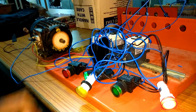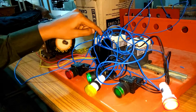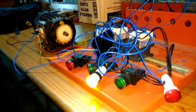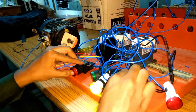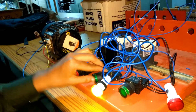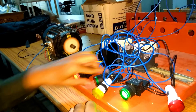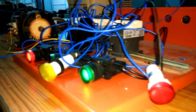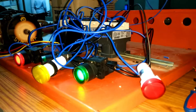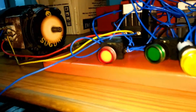Testing the trip indication: pressing the test button on the OLR causes the circuit to trip, the motor switches off, and none of the push buttons work. Pressing the reset button resets the settings, the motor can be switched on again by pressing the push button, and the trip indication goes off. This is how the forward reverse starter works for forward and reverse operation of the motor.